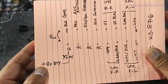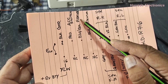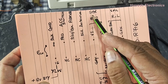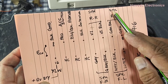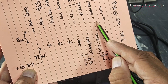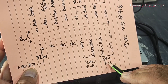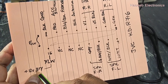To recap the wiring: pin 1 black wire is ground; pin 2 red wire is the ignition switch; pin 3 blue-black is the remote for the JVC amplifier; pin 4 blue is for the power antenna; pins 5 and 6 violet and violet-black are positive and ground for the rear right speaker; pins 7 and 8 green-black and green are return and positive for the rear left speaker; pins 9 and 10 white and white-black are front left speaker; pins 11 and 12 gray-black and gray are front right speaker; pins 13, 14, and 15 are not connected; and pin 16 yellow goes directly to battery positive.